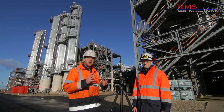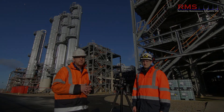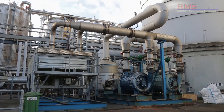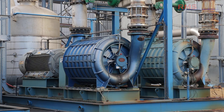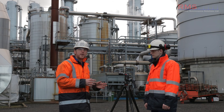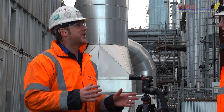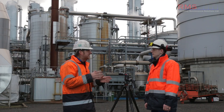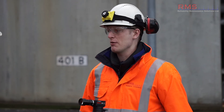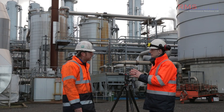We're going to talk about some other updates for the camera system. Over the last year there've been some fantastic updates to the Iris M system. The first one is the frequency displacement module. Keith, you've got a vibration analyzer — what benefit is having this capability within the system? It's fantastic, because we can take non-contact measurements with the camera. We've got that visual aspect, but the fact that we can take non-contact measurements anywhere in that image is really powerful.